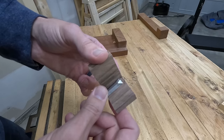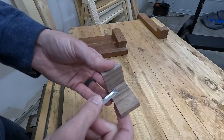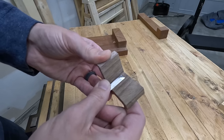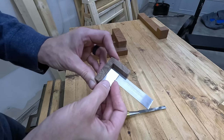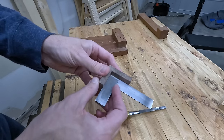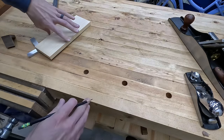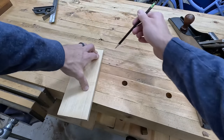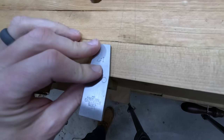This is actually the kind of stuff that's most dangerous when it comes to hand tools — that chisel popping through and slicing into a finger is a pretty common hand tool injury. I do a check to make sure it's pretty close to square on the inside. I like my workbench just like my truck — not so nice that I never want to do anything with it. I'm marking right on the bench: one inch over, seven inches up. This is going to give me a one in seven ratio, which is the correct angle for dovetails.